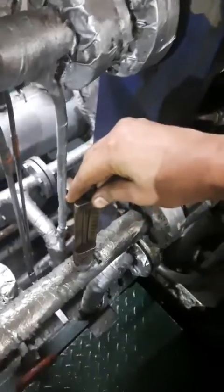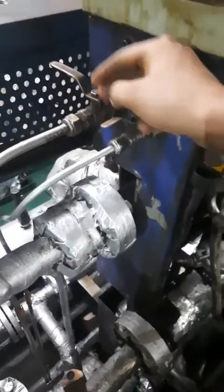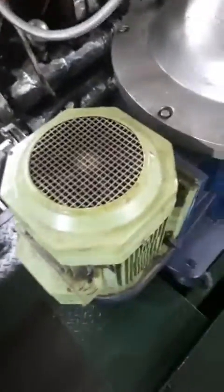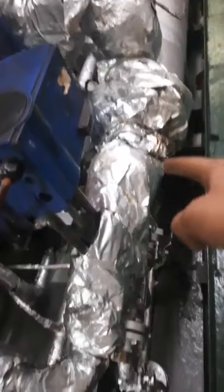Moving towards the air and the water supply, this is the air supply line which I opened and now we will open the water supply. So now oil is on, the air is on, the water is on. Next, we have to start the heater. This is the steam line going to the heater, the inlet and the outlet.